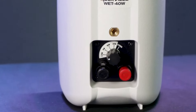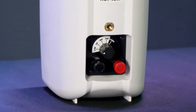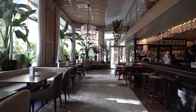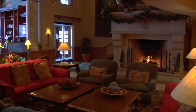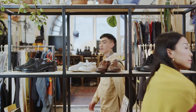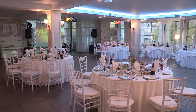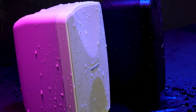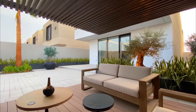There is a 4-setting 70V tap to use these speakers for commercial applications with the 70V amplifier, and these speakers are going to be perfect for installs in restaurants, bars, lobbies, offices, retail stores, gyms, dining halls, and because they are IP55 weatherproof and water-resistant, these speakers are going to work especially well for outdoor patio and bar areas.